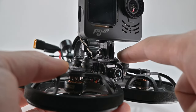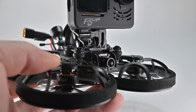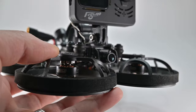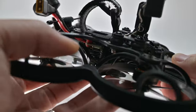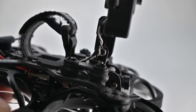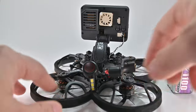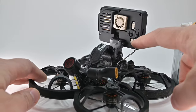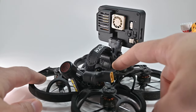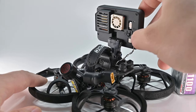I also have a GoPro mount on the CineLog — I printed this from Thingiverse and I'll put the link in the description below. It's not totally perfect; when I bend the camera forward, the whole mount kind of lifts right here. But I also have a wire that powers the GoPro from the FC — soldered directly to the positive and negative of the AIO. This way I can power it on, record, and even use the touchscreen to change parameters on the job.